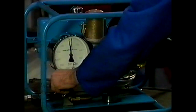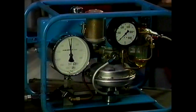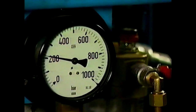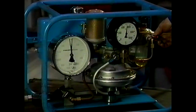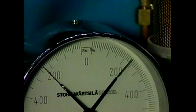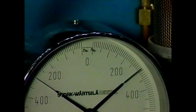Close the return valve on the pump. Set the prescribed hydraulic pressure as specified in the instruction manual by means of the reducing valve. The read-off value on the air pressure gauge indicates 10% more pressure than the real value read off on the oil pressure gauge — this has been done for safety reasons. Start the hydraulic pump by opening the air supply valve, and at the same time check at what pressure the nuts come loose. Turn back the nuts with a special pin and lower the hydraulic pressure.